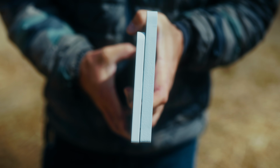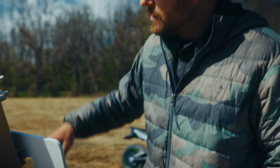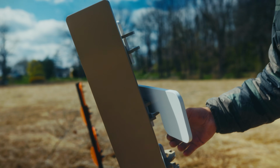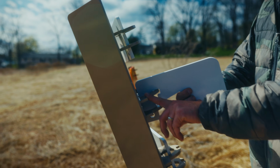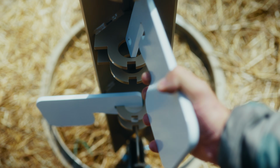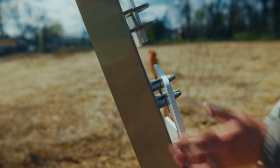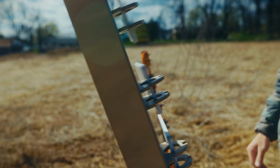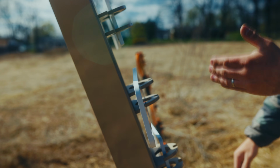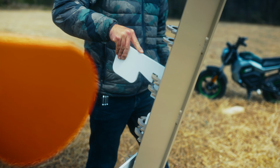But let's look at the back here, and we'll talk about the gussets and also how the paddles are stood off of the shield. So like I was talking about with the small dueling tree, a good dueling tree will have the stops built into the gussets. And what I mean by that is it's not resting up against the shield. So it doesn't matter what you do. This paddle, when you swing it, is not going to result in 4 other paddles moving.